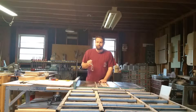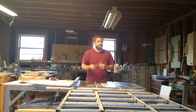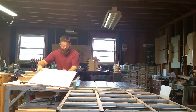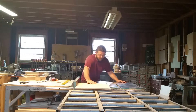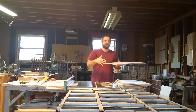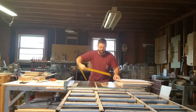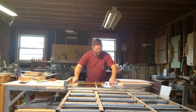If you don't have a table saw, just be very careful when squaring up. You can use a simple square against the edge of your box and cut to the line. The more square you are from the beginning, the easier the glue-up will be later. Since my mirror box is just over 20 inches wide, I'll set the fence at about 20 and an eighth for the first pass, then set it slightly smaller for the second pass, just to make sure we are good and square.